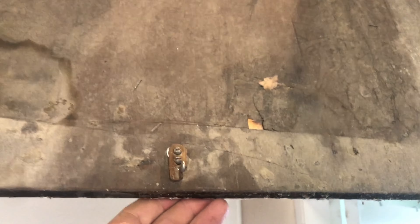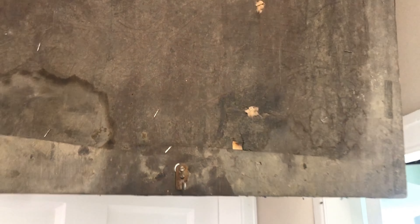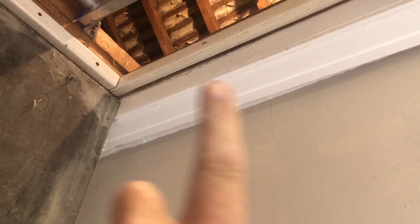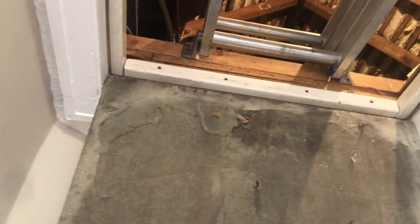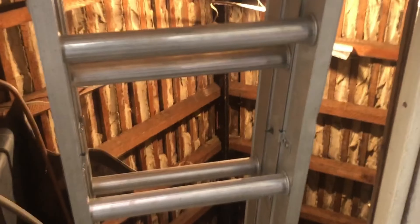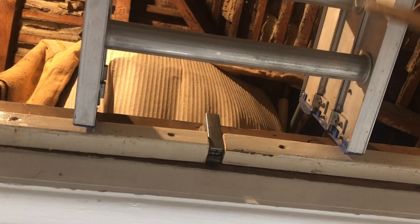I've now got some beading screwed in place on both sides - it gets a bit tricky, but that's two sides done. I've now gone round all four sides, so that should hopefully shut. We're just going to do a dry run without putting the sealant in and test fit the loft hatch before we put the draft excluder in.